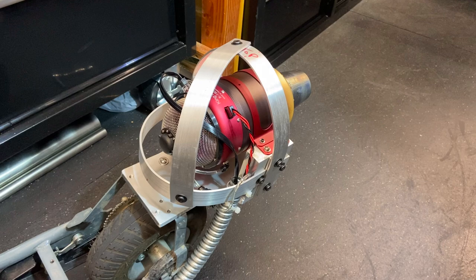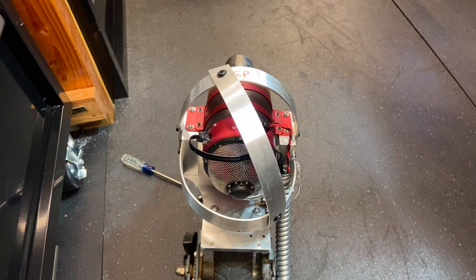Ended up using the hand wheel on my lathe. That was a pretty nice shape and a good diameter to get some of those curves. Also used the column on my vertical mill drill. That had a pretty good diameter for some of those curves. And when I needed some tighter bends, ended up using the live center in my tailstock on my lathe. That worked pretty well. So just find some good solid rounded surface and you can get in there and bend those curves. Just kind of fit them together until you get them the shape that you want. Pretty happy with how that turned out, and attaching that cross piece on there so that you're not kicking it from the side.